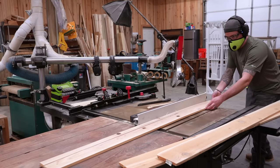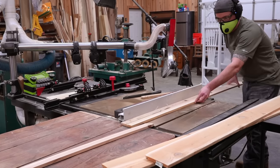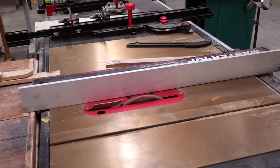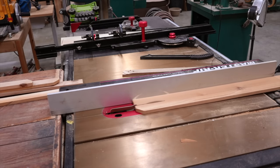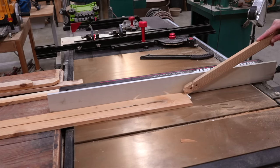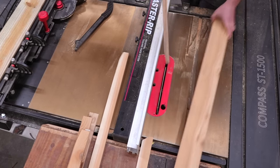If you're planning on painting this, go ahead and use pine because it's only two bucks per board. Just make sure that whatever pickets you decide on are actually five and a half inches wide. The cool part about this build is that every single part in this planter is one and three quarter inches wide. So I'm ripping all my pickets down to an inch and three quarter, and then we'll move to our lengths.